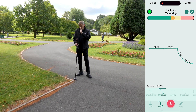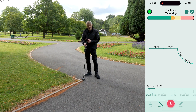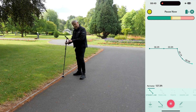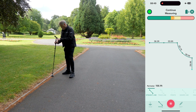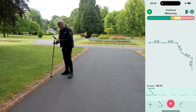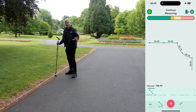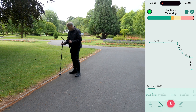Use pause points to look ahead, see where you're going to measure, and to choose your path type. I tap on straight line — it's now gone back into straight line mode. I'm not going to make this measurement in one go; it might be two or three segments. I walk along at a fast pace, turn gently, place it, and capture the measurement point. Remember the techniques: rotate gently, not abruptly, and place it down gently but precisely. We've already walked this site before we started — that's one of the tips: clear away any debris or branches anywhere you're likely to place your device for much greater accuracy.